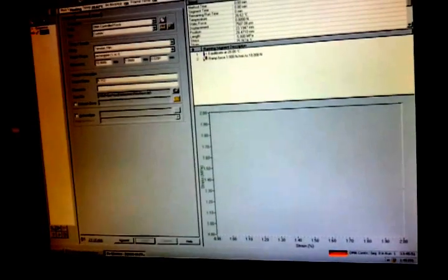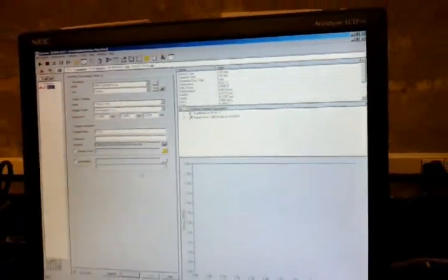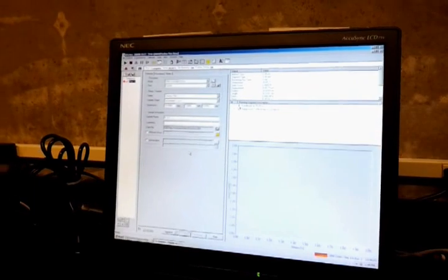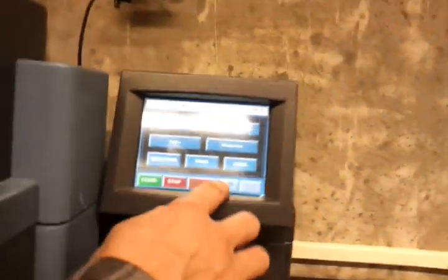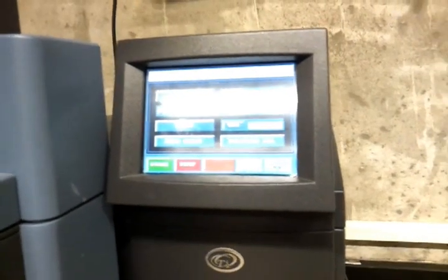After all is set up, just press Start and the films will start the test. Right now you should equilibrate first. Press Start — when asked how to save the file, go to Data Frame. The trick is: because you use a sample holder, you have to measure the initial length between the two clamps — the two tapes. If you use films directly like Rocio did, you don't have to measure the dimension manually because you can press Measure and it will measure the gap between the two clamps automatically. But since you use the holder, measure the initial length as close as possible before starting.